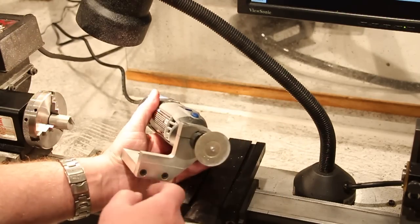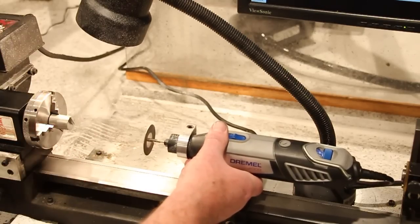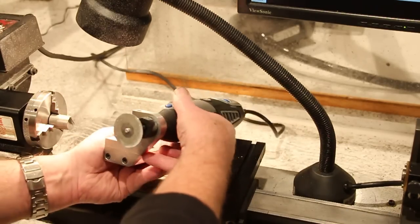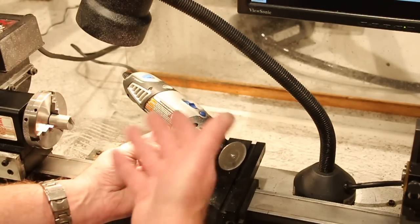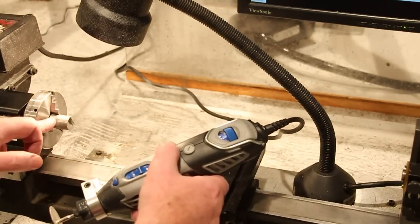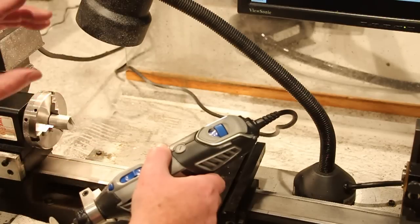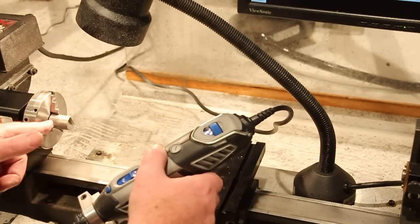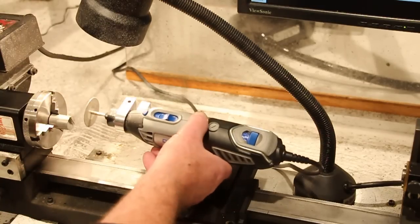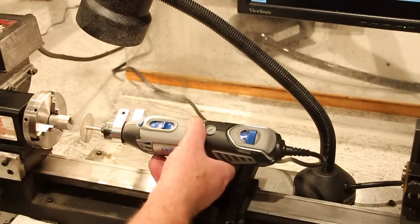And that's no big deal because once you got to this point, if you wanted to, you could just mount this on the cross slide, put a center drill in the chuck here and advance it in, and that would mark where the center line is, and then you could just mill from there. I didn't make all this just to cut test tubes. What I actually originally made it for is cutting axles. This project is going to have a lot of axles for holding the gears and the pulleys and the flywheel and all that other kind of stuff. So I put steel rod in here, I put in a metal cutting wheel, and this lets me cut very precise lengths, whatever length I need. And I'll be doing a lot of that later.